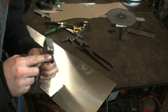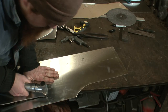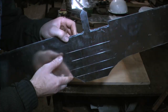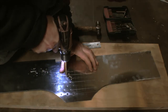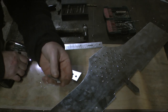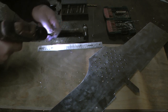I'm going to try this — it's an air-powered nibbling tool that cuts out little crescents, which are really sharp and end up sticking in your socks, at least that's what I found. It's not brilliant, so instead I might try one of these burrs from my die grinder — it should be much sharper. Yeah, that's better.